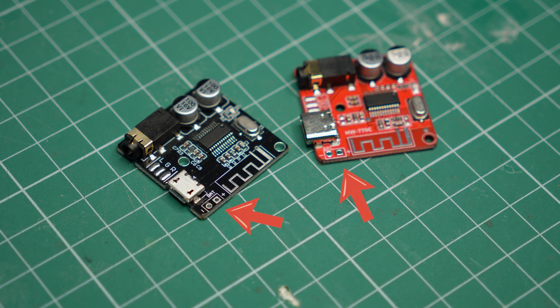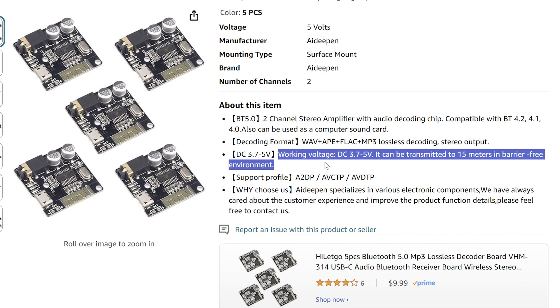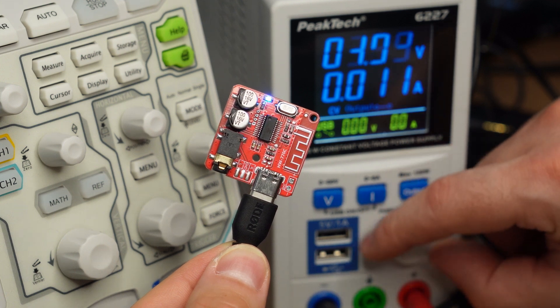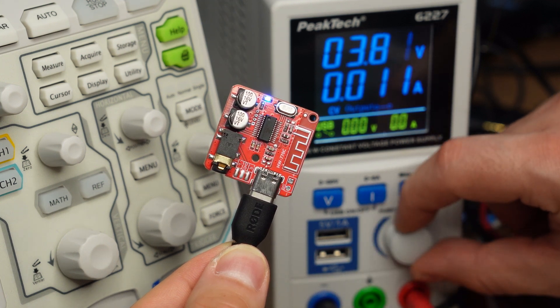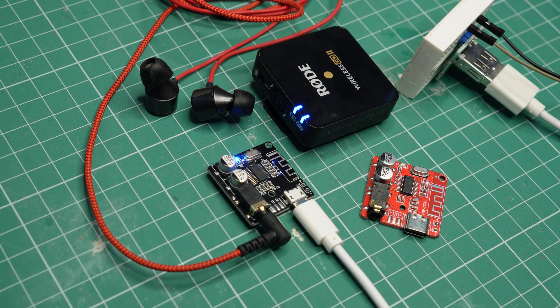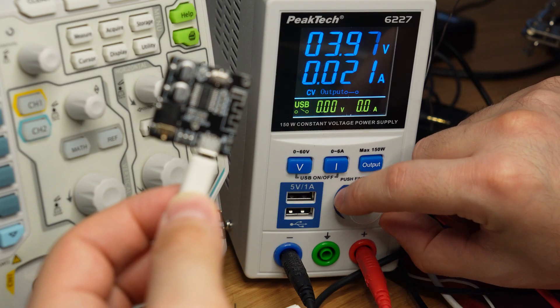You may also power the board without relying on the USB connector by soldering wires to the two pads on the board and connecting the receiver to something like a battery. According to their specs, the modules require between 3.7 and 5.5 volts to work. In my experience they will go down to 3.5–3.4 volts, but weird things start to happen — every 3 minutes they give an annoying low battery warning and the sound gets distorted. Be sure to power these with 3.8 volts or more.